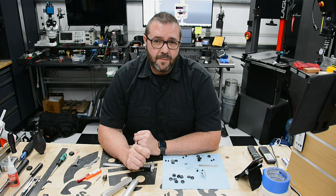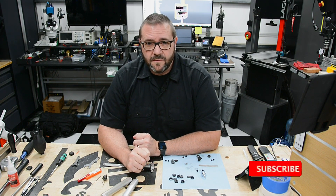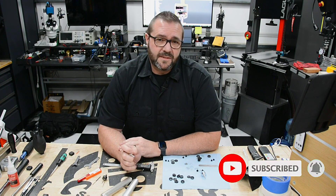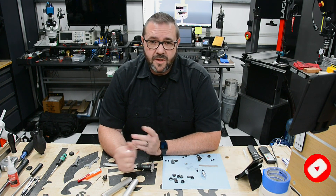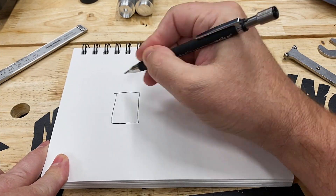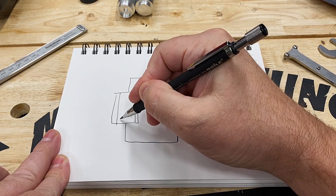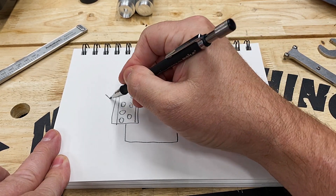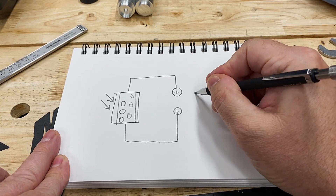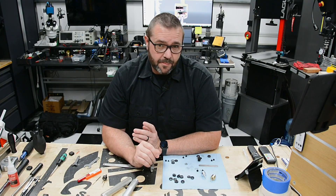While I immediately sought to find alternative solutions, the remaining functionality of the probe was tested with the assembled boards and custom connector in hand. I assembled the probe to find that the strategy I had planned had some flaws. If you're not familiar with how a piezo produces electricity, here's a 30-second explanation: piezoelectric crystals are sandwiched between two conductive materials, and when the piezo crystals are stressed by pressure or material deflection, they create a slight electrical potential difference. That microcurrent is measured and used to detect touch.